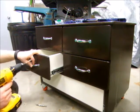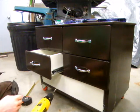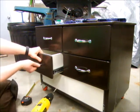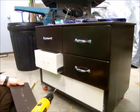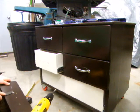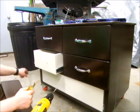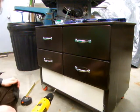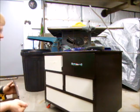I'm holding the drawer fronts on by putting through bolts through here. Before I put nuts on the back and get that down permanently, I'm going to pull the handle all the way out and rip it off — it's just hot glue. I'm going to take a chisel and chisel the hot glue off, because that hot glue adds thickness and I want these to sit flush against my drawers. It kind of just falls right off like tape. Now I can put nuts on the back and tighten it up. And if you don't get it the first time, rip it off and try it again.